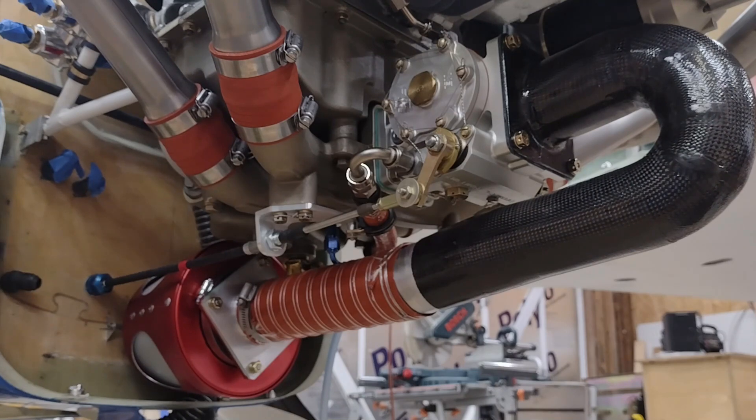I have an electronic actuator inside of the hellhole that's mounted vertically and opens and closes the valve. There are two operating functions of how the air is drawn into the system. One is through the Ram air scoop, which is on the centerline of the aircraft — that takes the velocity of air, turns it into pressure, brings it through the center with no filter, through the center of a conical shaped can filter, right down the center into the fuel injection servo.